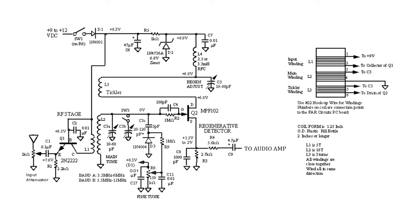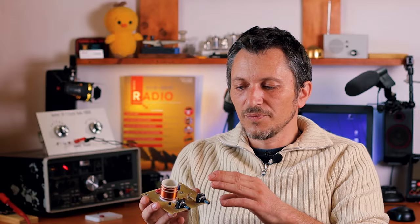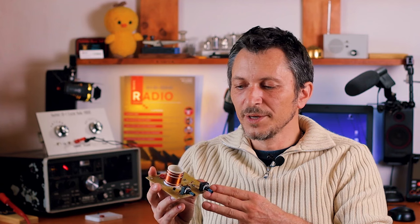The idea is simple: we're going to start with this schematic, get rid of the big coil and replace it with a toroid coil, replace the regen control with a potentiometer, and do all tuning with diode tuning — completely getting rid of variable capacitors. Then we're going to add an audio amplifier stage at the end, probably done with transistors just for a change, to get rid of the LM386 audio amplifier.